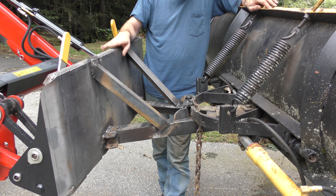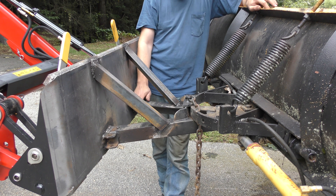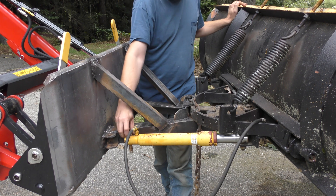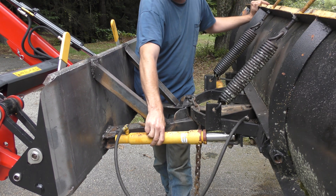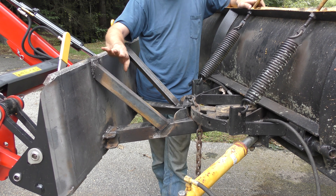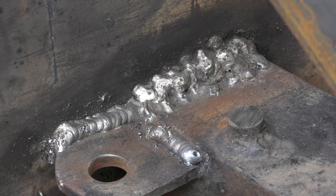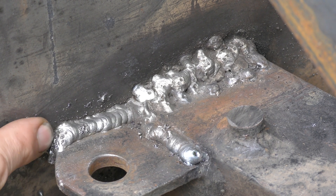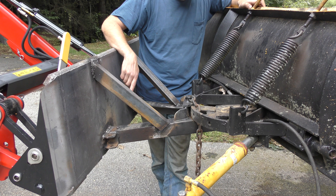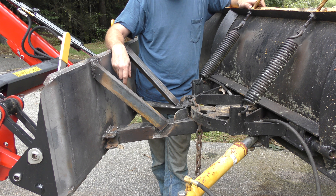It's all mounted up to its frame now. I did add these additional diagonal crossbars in just to help alleviate some of the stress against this area. These are all set up where the cylinders will rest down into these tabs like this, and run the hydraulics that way. I didn't film any of the welding — the MIG welder I have did start off nicely but it's just not powerful enough to penetrate into this half-inch thick plate. So I brought the whole thing down to my son-in-law's shop; he has a stick welder with much higher amperage and we did some really messy stick welding, but it should hold fine. I am definitely not a welder, but it will do.